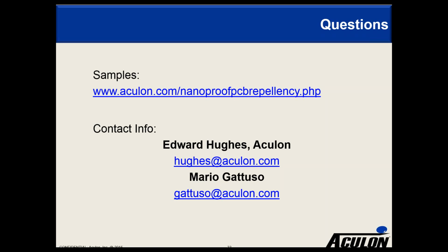And I think you in the chat said that the longest one was 30 minutes. Is that about the longest one? Yeah, 30 minutes. That's the sprayable formulation in 5.0. You can reduce the drying time by going to a solvent that evaporates faster. We can keep this flexibility in the formulation so that if the customer has a very specific set of equipment with a certain length of line, and existing ovens and so on, we can tailor the formulation to exactly what they've got. Again, keeping that theme of making it easy to use.